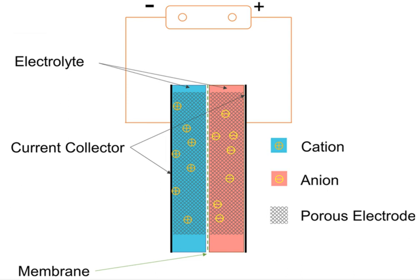Electrodes for hybrid capacitors. All commercial hybrid supercapacitors are asymmetric. They combine an electrode with a high amount of pseudocapacitance with an electrode with a high amount of double-layer capacitance. In such systems, the Faradaic pseudocapacitance electrode, with its higher capacitance, provides high specific energy, while the non-Faradaic EDLC electrode enables high specific power. An advantage of the hybrid-type supercapacitors compared with symmetrical EDLCs is their higher specific capacitance value as well as their higher rated voltage and correspondingly their higher specific energy.